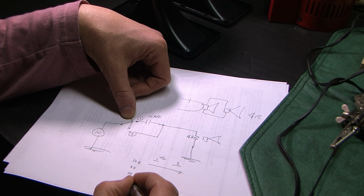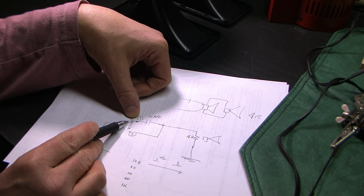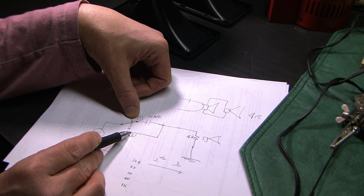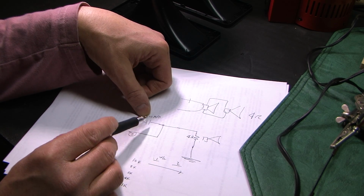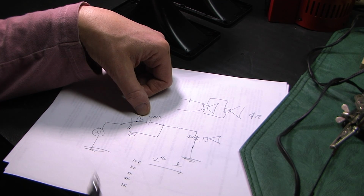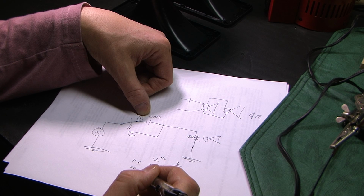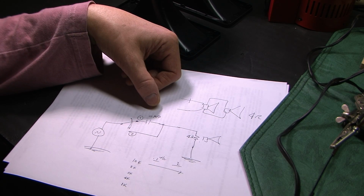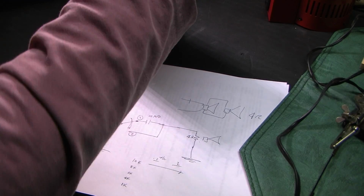But as we get lower in frequency, particularly down at the crossover frequency, when I go between the capacitor and the straight wire, the level should go up. Because when I'm at the capacitor side, it should be cutting the level down in half. So I'm just going to take some measurements like that to verify that. I'm going to actually have to have these tweeters facing up when I do that.